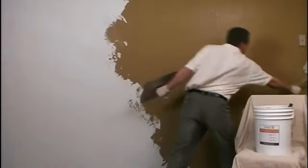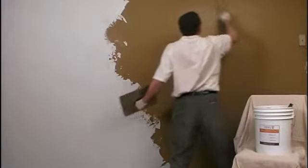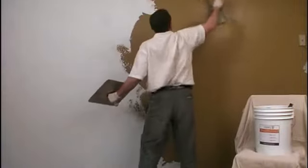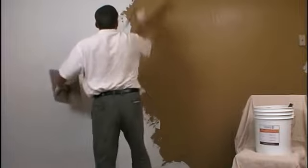You can do the first coat in sections if you're dealing with larger spaces. Make sure your dried seams are well feathered in random patterns. Apply it thick enough so there's no chatter as a result of applying the plaster too thinly. The first coat should be thick enough that the second coat has enough material to absorb into and create a decent mineral bond. Allow at least 24 hours to completely dry. For your second coat, apply the plaster slightly thinner, just to the point where you don't let it chatter.